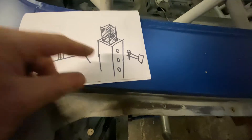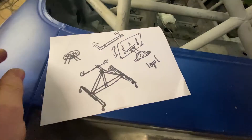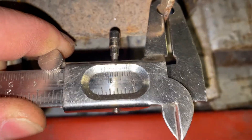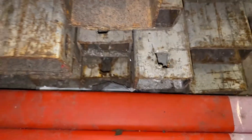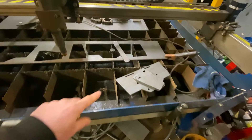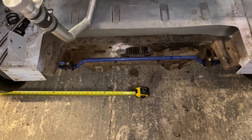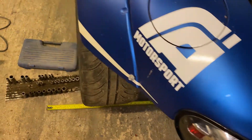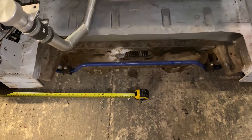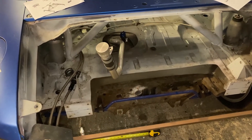I did think about doing a sliding center bar so you could adjust the height, though that would probably have a little bit of wobble. I should have enough scrap material lying around to do most of this — we've got all this box section here, sitting right at about 2mm wall thickness, which should be ample. I've got plenty of scrap metal on the plasma CNC so we should be able to make up some nice shapes. Measuring from the center of the vehicle out to the edge — that's 110mm — so we'll have that much clearance.